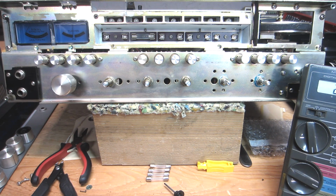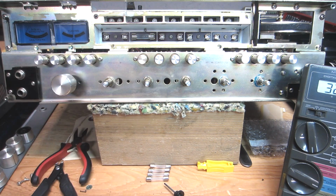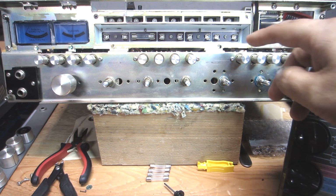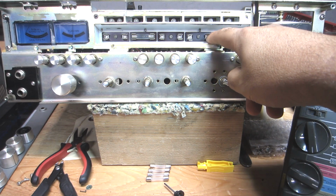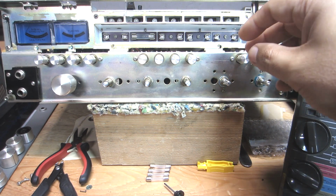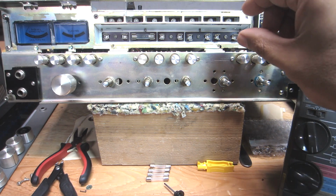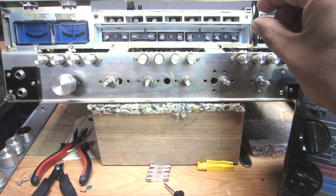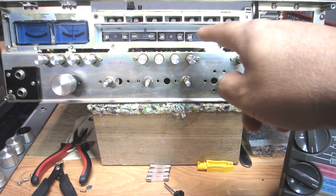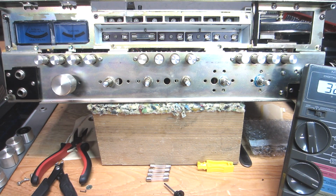compromised connection somewhere on the board. Even the lamp sockets themselves, these lamp holders, I've seen them badly oxidized, tarnished. I've even seen these fuse type holders that have loosened up, and the bulb is not making really good contact there. So sometimes you need to retension them, kind of squeeze them slightly together, and then of course clean the contact surfaces, and then you're good to go.